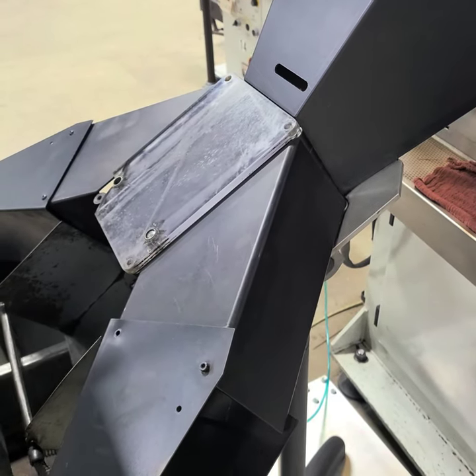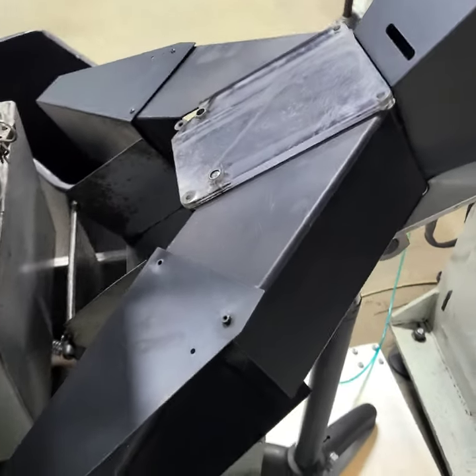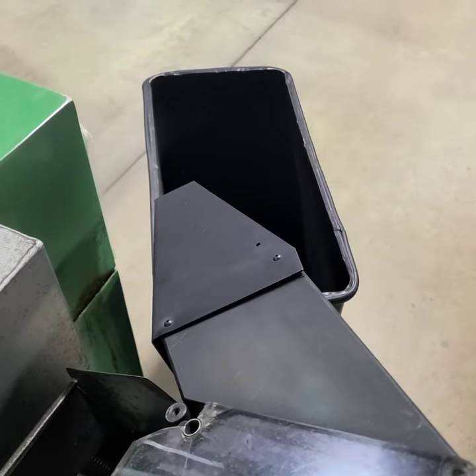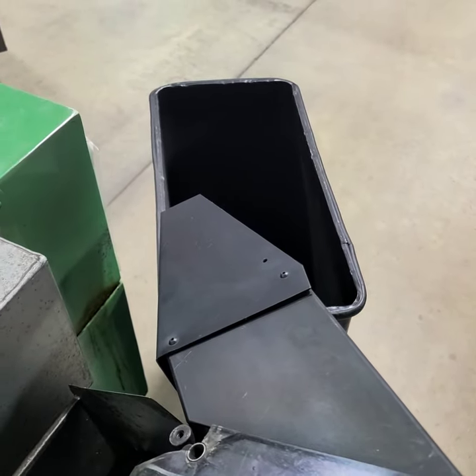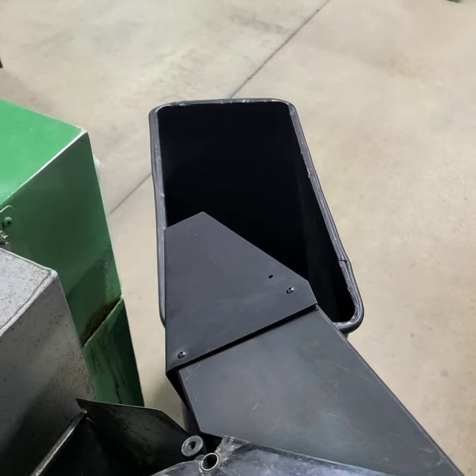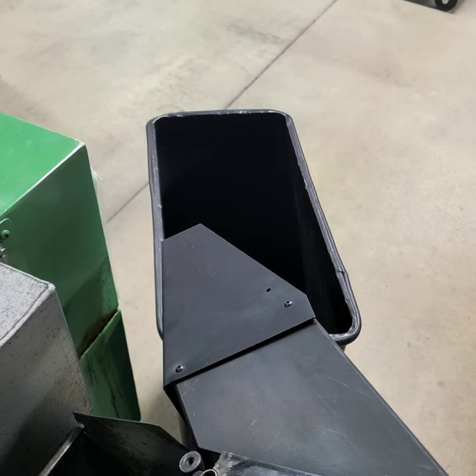The springs that are either too long or too short are directed to the side by a flapper in the sorting chute. These long and short parts are considered scrap, which we send to a metal recycler. The amount of springs scrapped is dependent on the tolerances of the spring forces on the customer print.